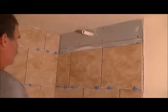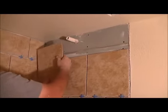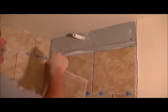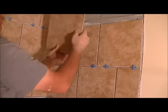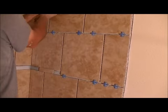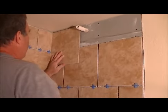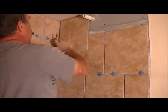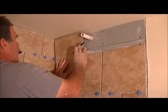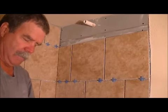Okay, let's cut this piece — this is our last piece. I've already done all around, but here's a quick way of doing the top ones. This is the top; we've been keeping the white up. What we can do is turn it over, and how you do this is you just set it in place and go against this one, then mark it like that — a little mark right there. We'll cut that. Then you don't have to spend time measuring and minusing — I've already done it.